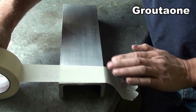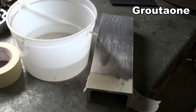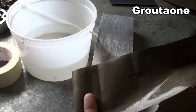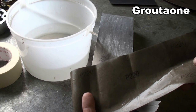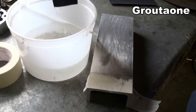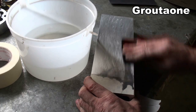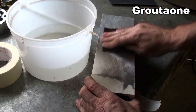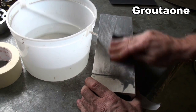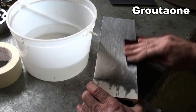The first part here doesn't get any sanding — I'm just going to cover it up with tape. I actually have 220 wet paper at home, not 320 as I said before. It's a little on the aggressive side, but when that polishing wheel starts going the wheel itself removes just a little bit of aluminum as it polishes. My goal right now is just to knock down all those manufacturing little grooves that kind of look like scratches, and get rid of all of that.